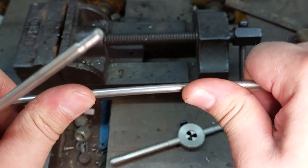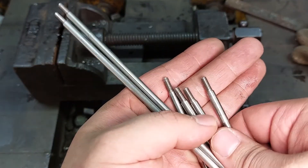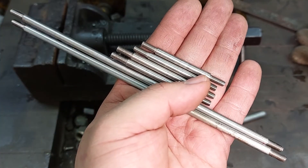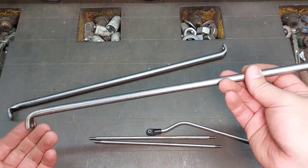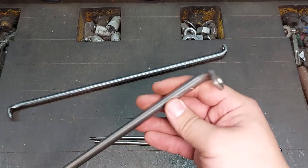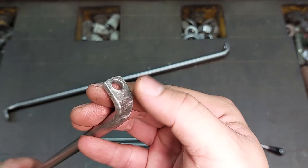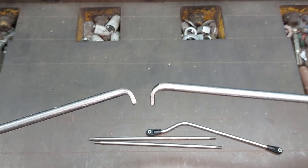In a little over two hours we've created six links — really nice and strong stainless links. Now I'm going to put bends in them. I'll show two ways: a sharp bend using the vice and a radius bend. For the radius bend I'm using a tool my grandfather made — it's essentially 3/8 inch stainless rod that's been bent and hammered with holes drilled on each side.